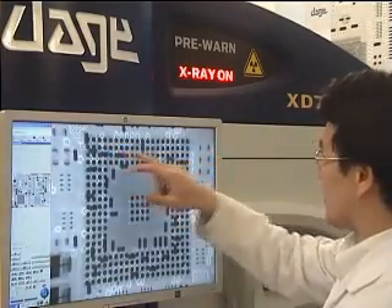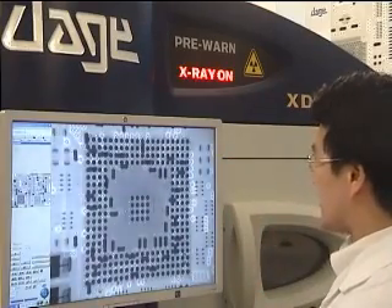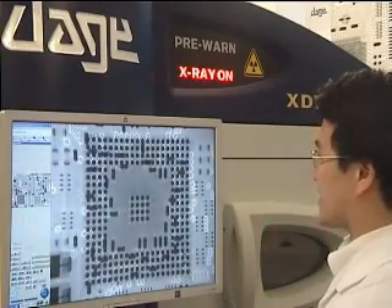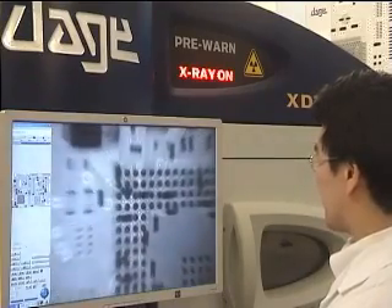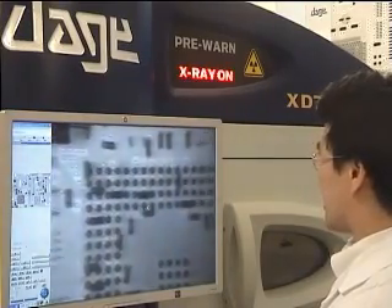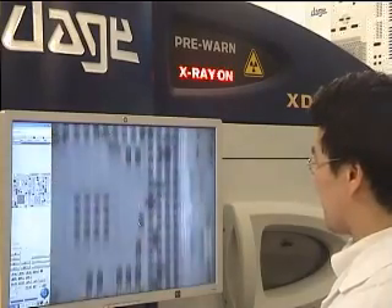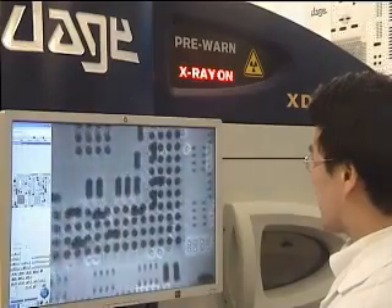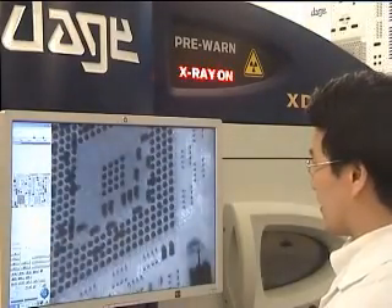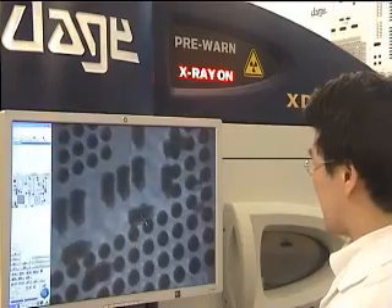You've got rows and rows of essentially solder balls. The object of this particular part of the exercise is to quickly make sure that all the balls are generally quite round and generally similar in size. We're also able to perform what's called an oblique view scan, where you can have a look at each of these individual balls from a tilted angle.